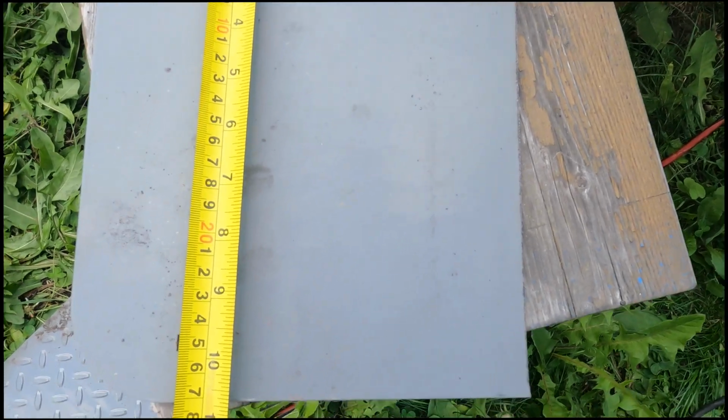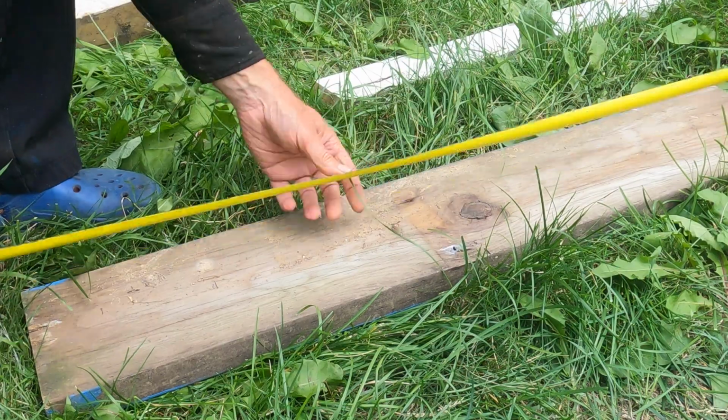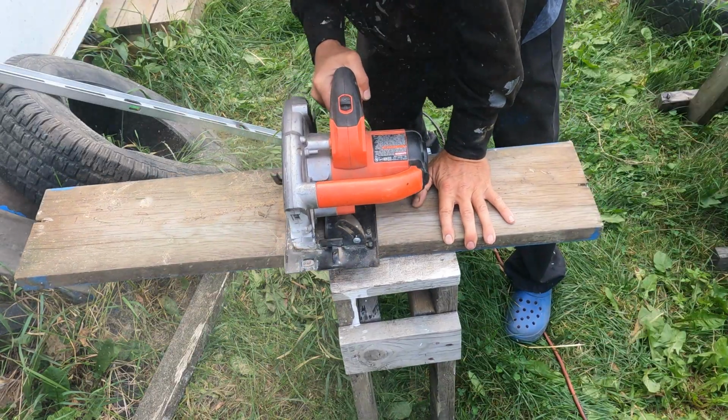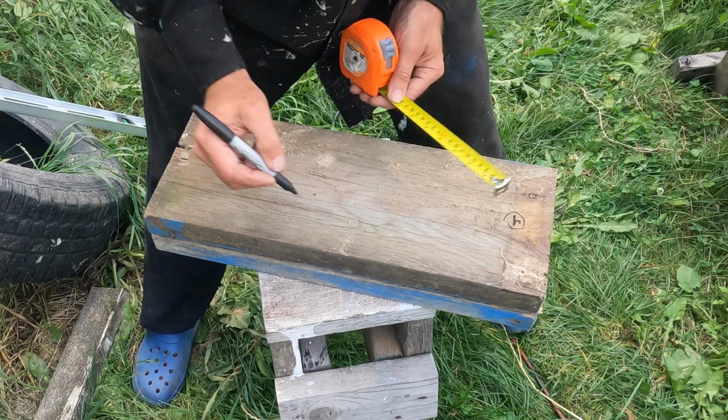Thirteen's a lucky number, right? So I'm gonna make the width of this press 13 inches, and the plate there is only about 10.5, but it'll give it enough strength, I think, to make it really good for a press. I'm gonna put 1/2-inch holes in there, and then it's gonna start coming together, guys. Big time.